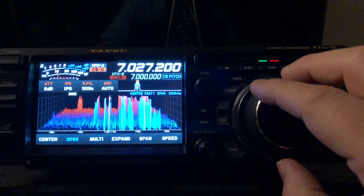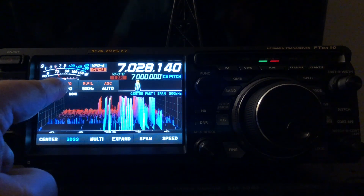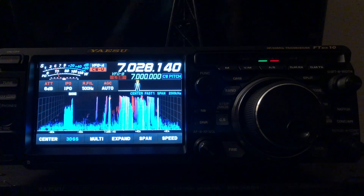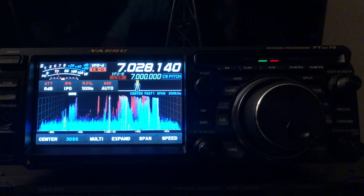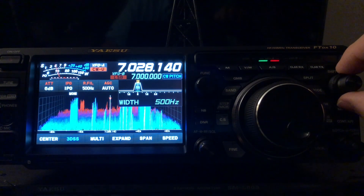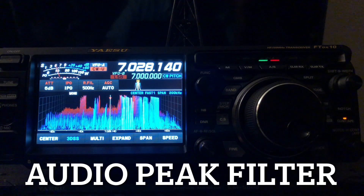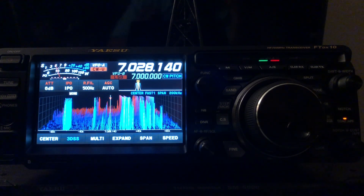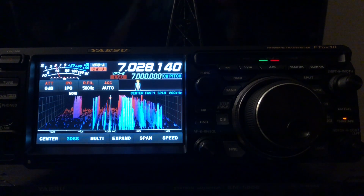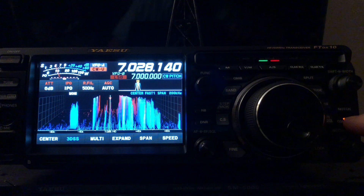When you're really tight on the filter you may skip over signals, so I watch the indicator until it's centered, then tighten the filter width. We're already 500 Hz tight with a crystal filter, and now we're digitally tightening it down to 50 Hz. Then the audio peak filter — look what that does: it magnifies that particular frequency. Set for 600 Hz, it pushes everything that's not 600 Hz out of the way, reaching down and boosting that signal.